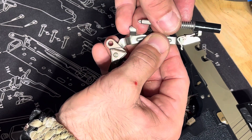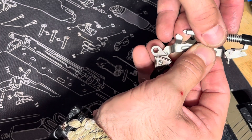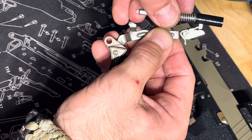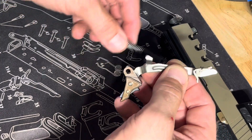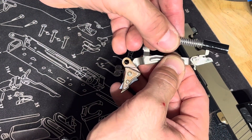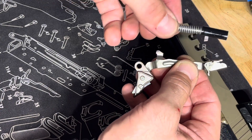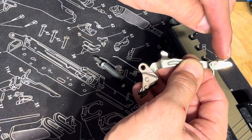Basically the way it works is it's supposed to press your trigger — your firing pin lug back. Then when the trigger drops, the firing pin goes forward and fires. And then when it comes back, it grabs the back of the sear and lifts your trigger up, and this is what resets your trigger forward. When this doesn't happen, it's because of the sloppy tolerances — it's barely grabbed on like this, and then when it falls it slips right back over the top. The only way to fix this is you have to adjust your sear angle right here.